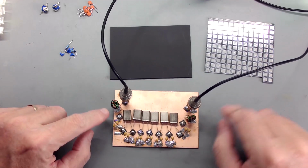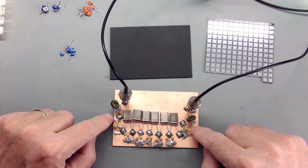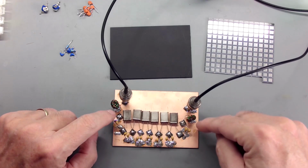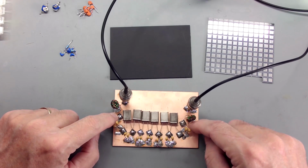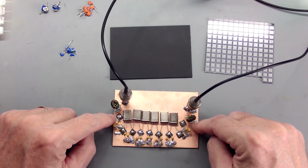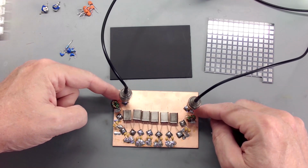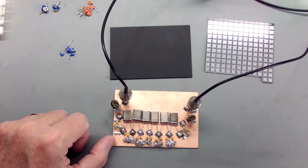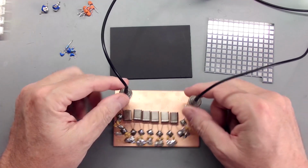And so then what I did was, in place of where the resistors were in series, I plopped these transformers in. One side of each winding goes to ground. The higher winding count, because your impedance is higher on your crystal filter, goes to the input and output of your crystal filter. The other end goes to the connectors. So basically your signal goes through one winding to ground for the transformer, the transformer does what it does and converts it onto the other winding, which then gets shipped out or in, depending on how you're looking at it. So that's what it did.